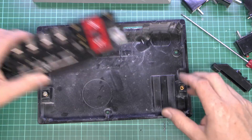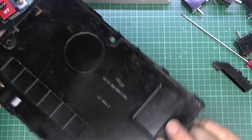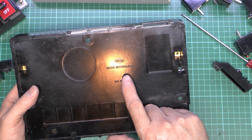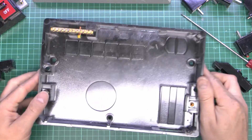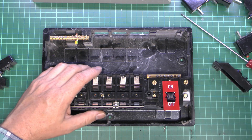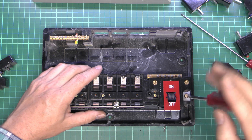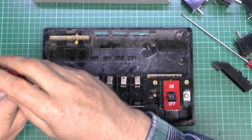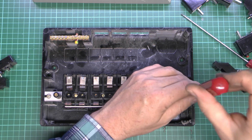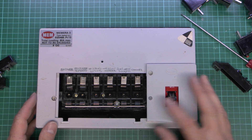After a bit of effort it does go back together, just getting all the parts properly aligned, and just the two screws to secure that in position. This piece just presses over the front handle. You've got channels here to allow cables coming in the bottom to come up from behind into the terminals. The inside is marked with 'top' in case you didn't notice. On the back you can see the part number BX11891, Made in England, and it's a MEM or Midland Electrical Manufacturing unit. These weren't as common as the Wylex, but certainly were reasonably well used in the mid to possibly late 1980s, although these circuit breaker versions are the more uncommon variety - most had the fuses, either rewireable or cartridge style.